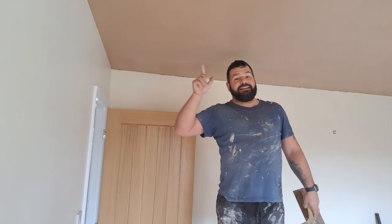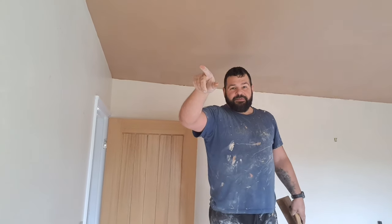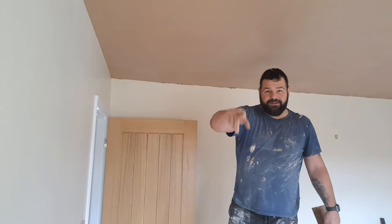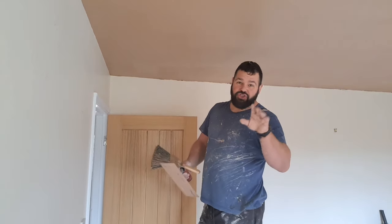That's ceiling one flattened. Now it's time to flatten ceiling two. Switching to a smaller speed skin because it's a confined little space - you don't even have to use these, you can just use your trowel, it just takes longer. Now ceiling two is flattened. We give ceiling one the first wet trowel, then we give ceiling two a second coat. After the second coat we hit the little star on the chart, go to ceiling three and first coat that one. Then the process just follows down each stage, going each ceiling at a time.